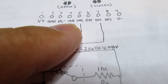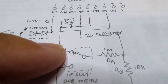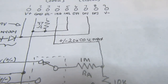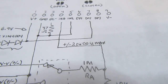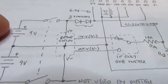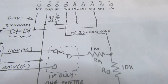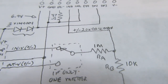And then the input high, INH, is connected to either the op-amp input or output circuit, but it can be scaled to different voltages, but it really only can work with, I think, 0.2 volts. And you have to scale the input voltage down. Since I can have a swing of almost 10 volts above or below ground, I needed to get that below 0.2 volts, so that's a factor of 100.